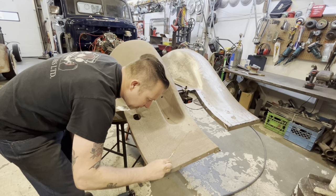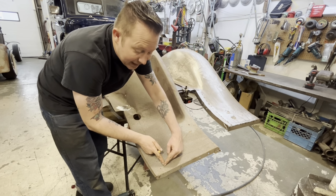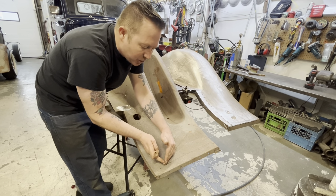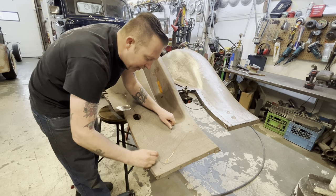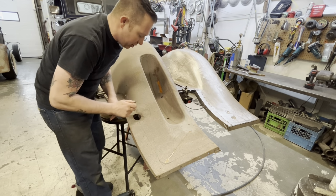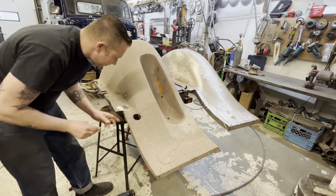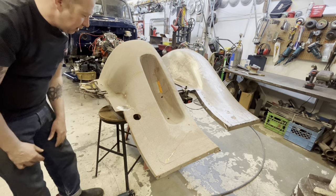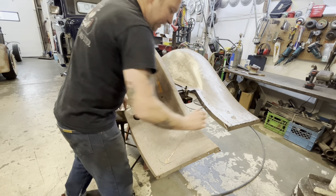Let's put a little bit of radius on this. If you have your welds come to a 90 degree point like that, that's a big area for heat to get trapped into, which can cause more distortion. But if you radius your ends like that, there's no corner for the heat to get trapped in, and it makes it nicer to work with. It's a little bit harder to cut out, but all right, we got a little radius there, a bigger radius there. Let's drill our spot weld out first and then zing that guy out.